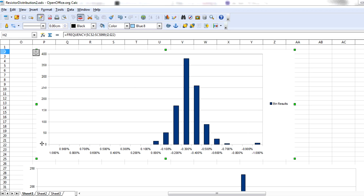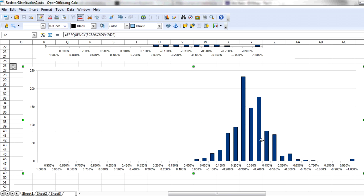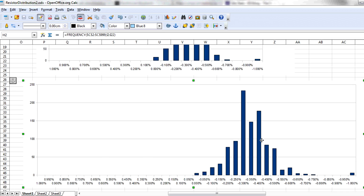They may have designed for a 6 sigma response for 1% over that range, but you don't really know unless you're the manufacturer to know what actual system they put in place. They may have been working to 3 sigma 0.5% instead of 6 sigma 1%, for example. So anyway, if you want to look up standard deviation and sigmas and how it applies to all this statistic stuff, there's better places to learn that than here. But there you go. It's a rather interesting response. So we'll try the 5% tolerance carbon film resistors and see if we get a different response.